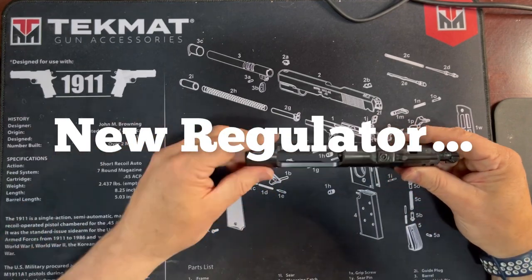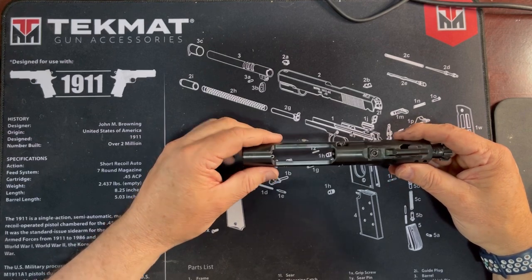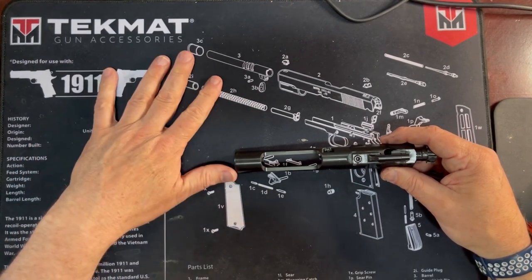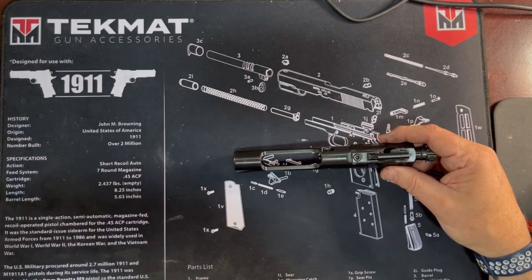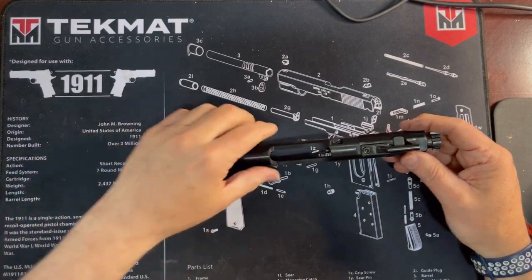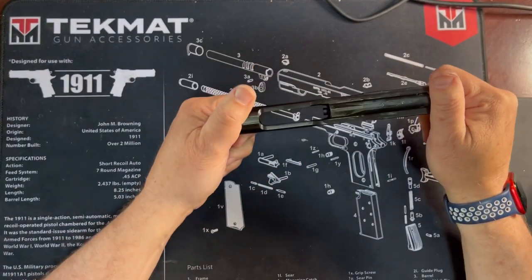When he gave me those thoughts, I figured I'd keep trying the new regulator — in yesterday's video I said I was done with it. So I put it back on, made sure everything was tightened down: I checked the gas block again at 35 inch-pounds, and the handguard at 55 inch-pounds. I previously said foot-pounds, so my apologies — and thank you to the user who corrected me on that.